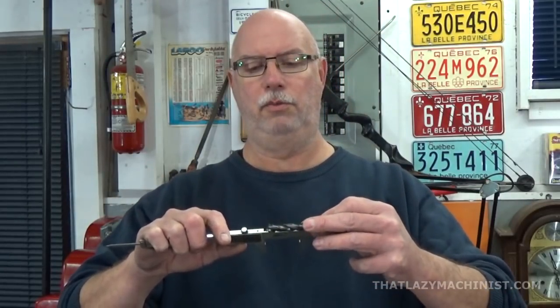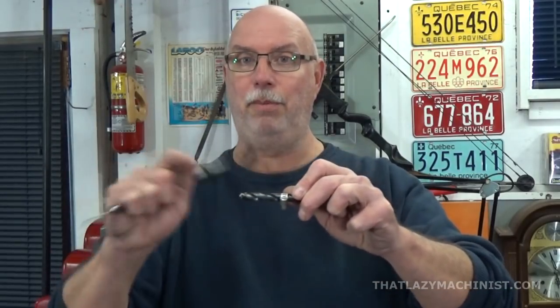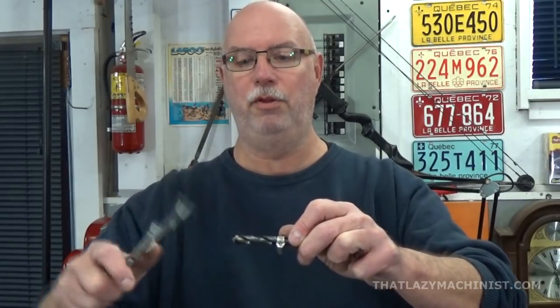I'm going to want to drill and ream the hole. So I'm going to want to drill, as we can see here, just slightly deeper than the length that I've set here. And when you measure the depth of the drill, I mean the parallel hole that it's going to produce, I start on the major diameter starting point, not on the tip of the drill.